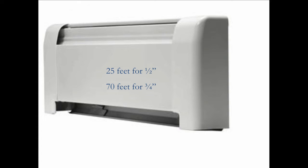He says, I like this. I could see this. I said, great. Work with me here. So the train starts up, and the 40,000 guys get on the train and head out into the baseboard. Now they're moving into baseboard element that has air moving across it. So that's like getting off the train. Every linear foot that they travel, about 600 of these guys hop off the train. That's where they work. They're going up to their office. So every 600 BTUs come off every foot. By the time you get past 70 feet, you're basically out of guys. The train's going, but there's nobody on it. That's why you don't have any heat.